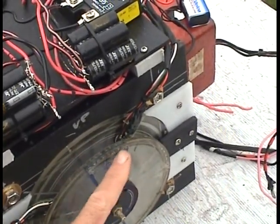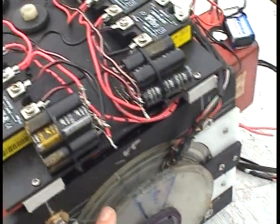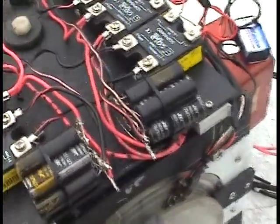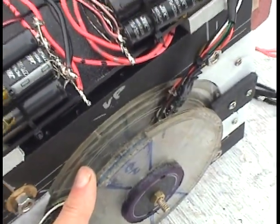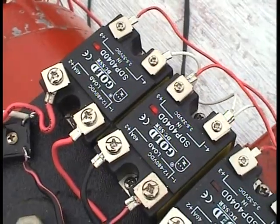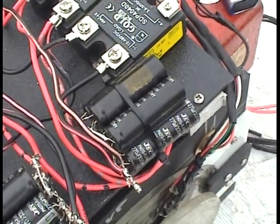Down here are the magnets, so when these magnets go by the hall effects, it's going to trip through all the timing for this bank here. Right now the magnet is not over the hall effects, so what happens is these two relays are on — see that, the red LEDs are on. That's allowing power from that full wave bridge rectifier right there to fill up this capacitor.